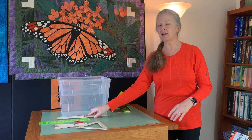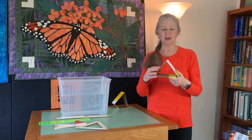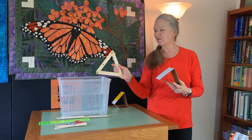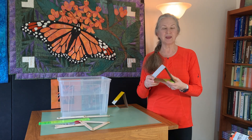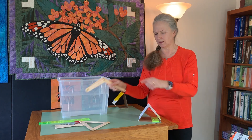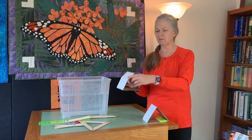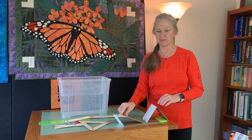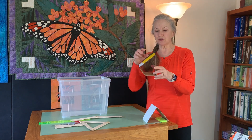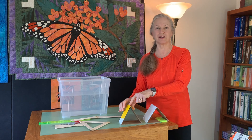You can incorporate these in lots of different ways. Our surf boat design incorporated cardboard tube trusses — basically a thicker version of a wood truss. The key thing to note is that for cardboard, a fold acts a lot like a pin joint. So if you inadvertently create another bend in a side of your cardboard, now you've got a mechanism — but you can still salvage the truss if you turn it so the straight sides of cardboard are carrying the load.